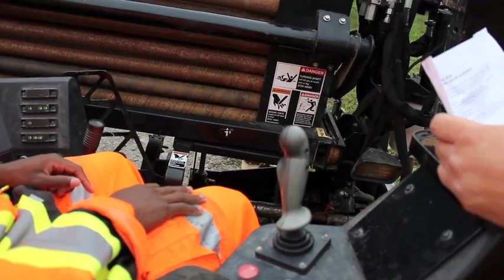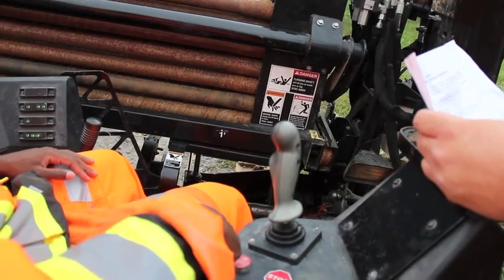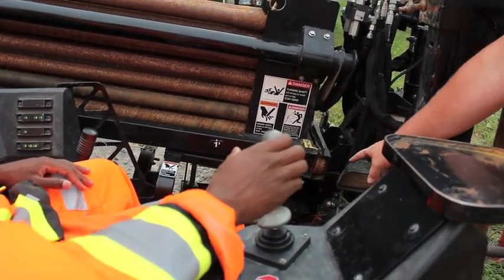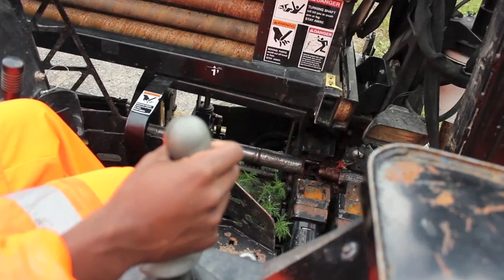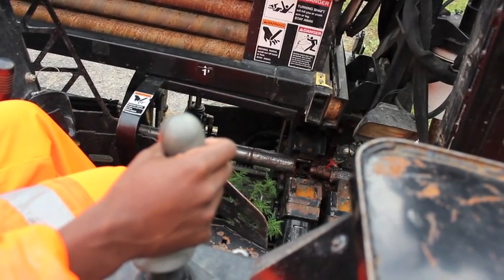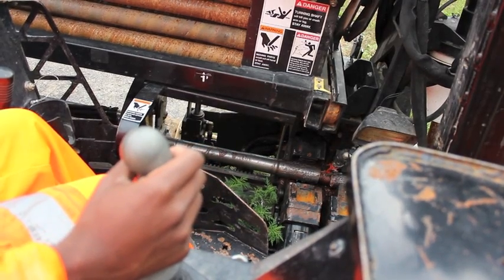Number nine: move the rotary head forward until the rod joint meets at the front vise. Move it forward until we close that gap, but don't put any weight on the press. Just blend it together. There you go, that's perfect.